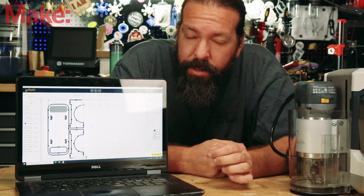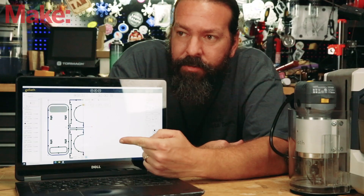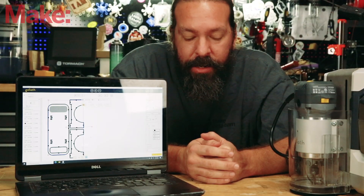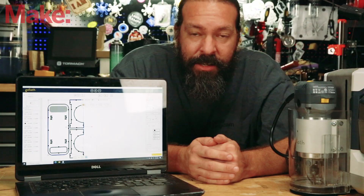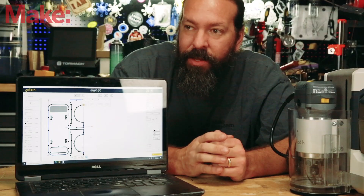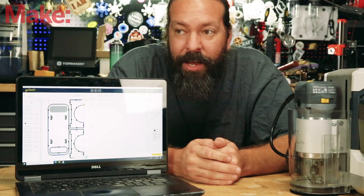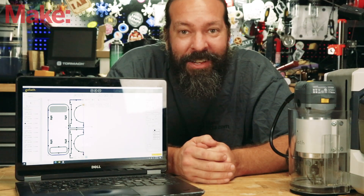Now let's talk about the software and the actual process for cutting. With the software, they are really trying to make this as user-friendly as possible — it vaguely reminds me of something like Easel. Here we have the interface, it's called Slingshot, and you bring in SVG files. Unfortunately, you're not going to be doing your CAM stuff in other software and exporting G-code, and you're not going to be cutting 3D files. This is really 2.5D, so that means you can cut outlines and shapes, and you can even do pockets, but that's it — no contours like a human face or something like that. You can actually see where the black lines are the outlines I wanted cut, and that gray block there is a pocket.